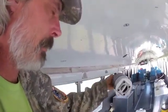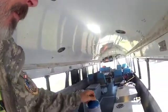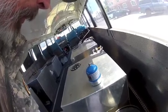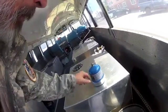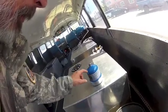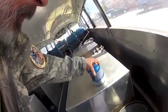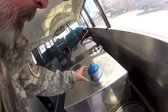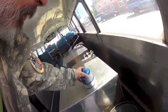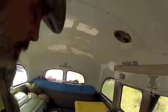So these, there's 2 of them. They'll be mounted on here, and the pump will be putting oil through it, and then into the tank will go the cleaned oil, and it'll collect the oil. The debris gets caught up in this bowl, and we clean this bowl out every 15-20 minutes or so. So those will get mounted there pretty soon. And that's pretty much how the fuel system works.